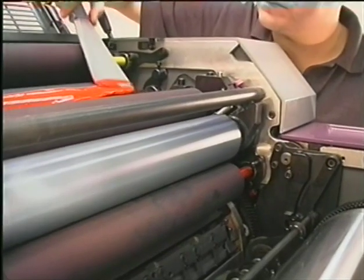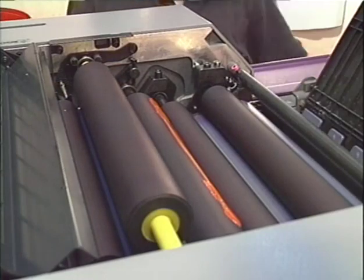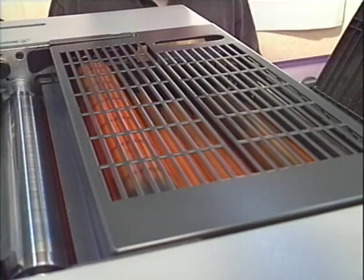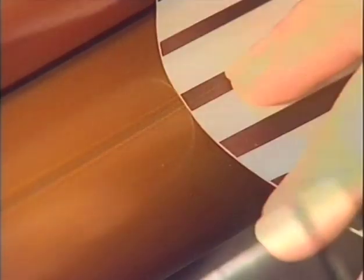For adjusting the rollers, you should put in some ink. Yellow or orange are best suited. Distribute the ink. First of all, you have to set the ink form roller toward the ink distributor. The ink has to be spread evenly. Stop the press and wait a few seconds. Now move the press until you see a stripe of ink.